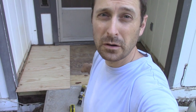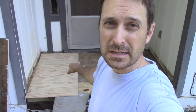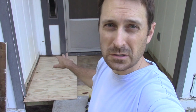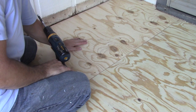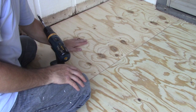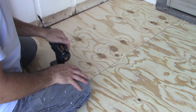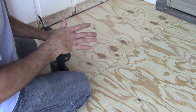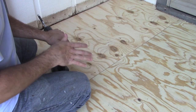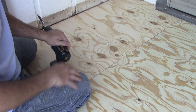We finally got things underneath repaired, and now we're going to lay down some quarter-inch plywood on the top. That's going to give us some tighter seams for our Red Guard — something a little bit more stable and a little bit more thick for our tile on top. When we lay down our base here, our quarter-inch ply, make sure you screw it every eight inches. That gives us a very, very stable platform. That applies also if you're going to use a cement backer board — same principle. You want it to be solid, a solid base for your tile. You don't want any movement in there.